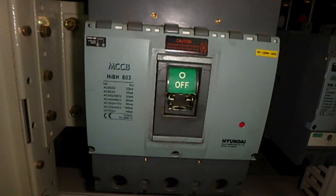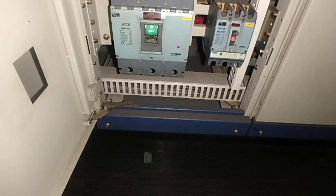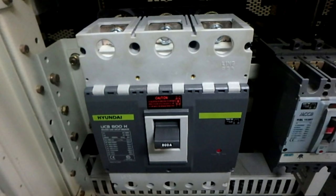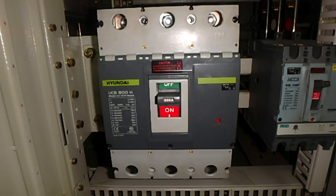The switch was old, and what is going on if the switch gets old? By the time the plastics will be destroyed, the connections will be destroyed, and it's very, very dangerous for sparks, for circuits and fire. This is the most important reason that you need to replace your switches, because they get damaged through time. As you can see here, the color is really bad. We do not really know what was there. It's paste or something else.